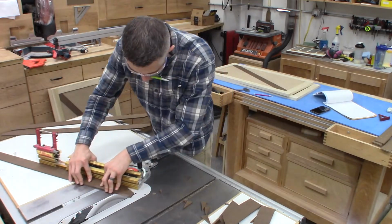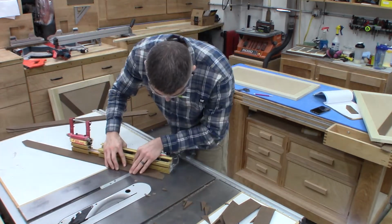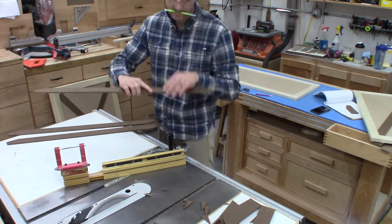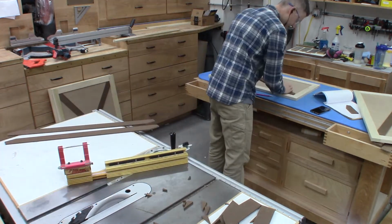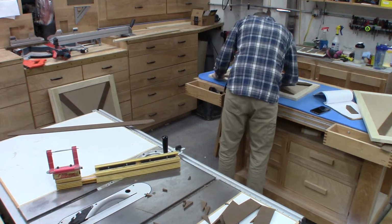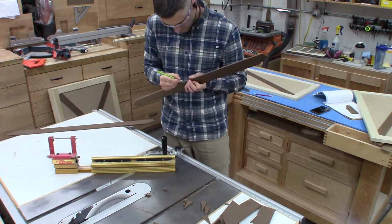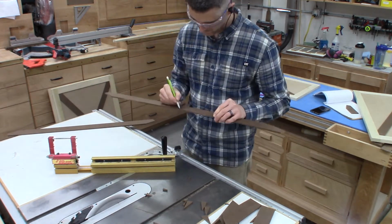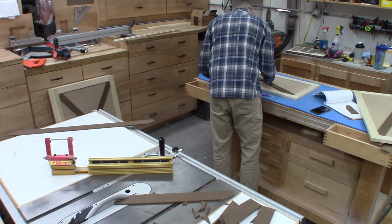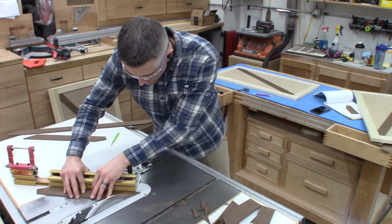So that door I made too wide, well, I forgot to remake my templates for it after I recut it. And so I had to do the old geometry method here by taking some measurements of the door from corner to corner, getting the angles, and then trying it out with the actual pieces and sneaking up on everything and just getting it, just finagling. That's a good word. A lot of finagling. But finally got these things fit into place after a number of tries.